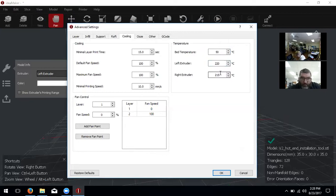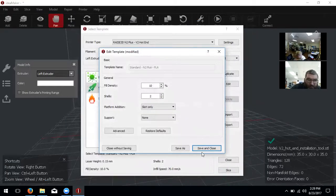You can use PLA at 220 and also at 210 — it'll print just as well at 220. For our filament we recommend 220, and their filament should print fine with it too. If it's making strange looks or not printing right, come back and adjust by about 5 or 10 degrees. We'll also change the right extruder to 220. That's all we have to change. Click OK, then Save and Close or Save As if you want a separate template.